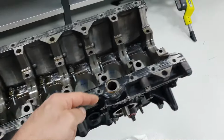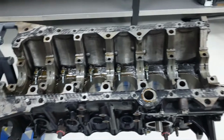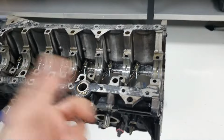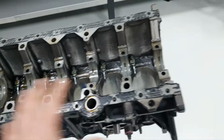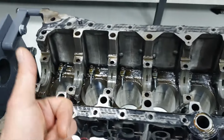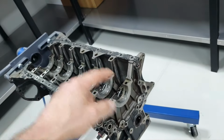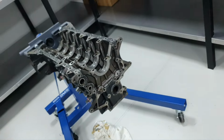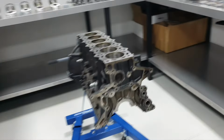Never mind. Let's make the block upside up. I'm going to remove the upper main bearings. I'm going to remove also the cooling jets at the same time, then make it upside up. Once again, it didn't stay for one year, obviously, but I don't see garbage inside. That's a good sign, at least. All right, removing the cooling jets and the bearings, then making it upside up and finalizing the video. Let's finish the video. Engine upside up.